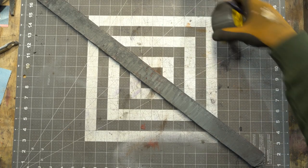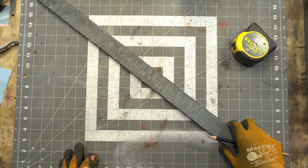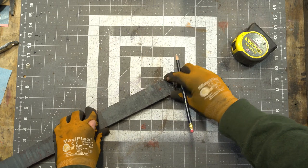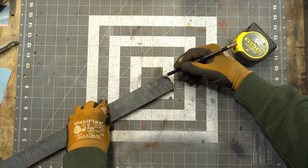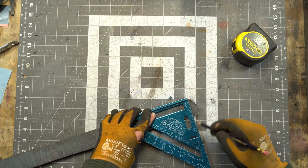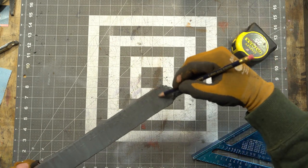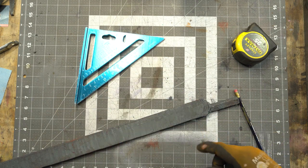It's all cooled off and we're able to handle it. Now we need to cut this thing up into sections, clean it up, re-stack it, weld it. The first thing we want to do is decide where we need to get rid of the ends, because these ends are always full of delaminations. We have to figure out where to chop this off to get rid of all the delaminations. This side actually looks pretty good, so we're just going to say about there. The other side's actually pretty gross, so we have to cut up to there. So the ends are gone.